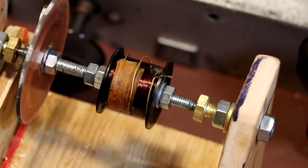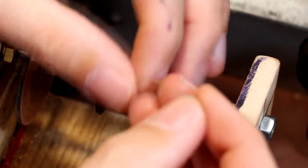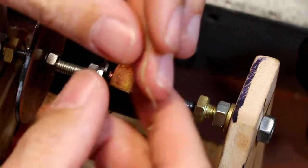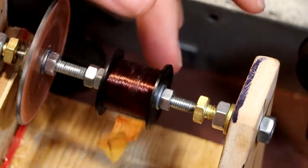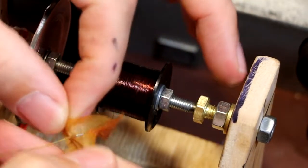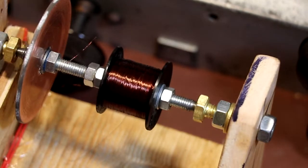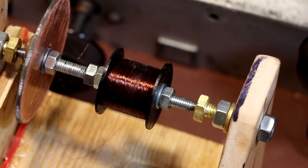It looks as though this thicker wire here, I don't know if that's a different piece of wire. Yeah, that looks like a piece of tinned stranded wire, so I'm assuming that if we just unwind this, it should actually be soldered onto the thin winding, which it is. It's soldered on. Better make a note of that. 5,187 is the centre tap.